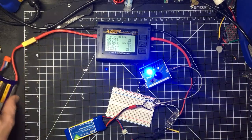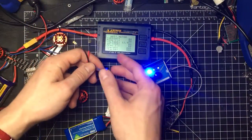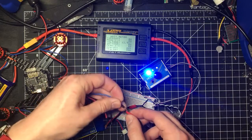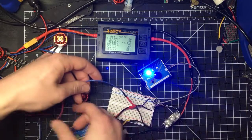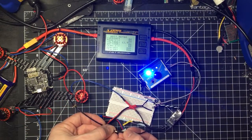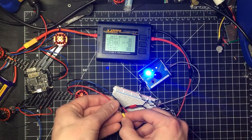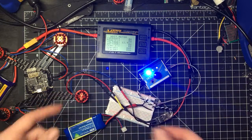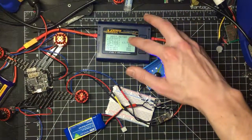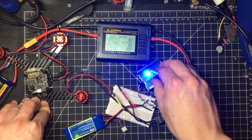And so the last thing naturally is to bring over our motor to test. So I'm going to test this guy right here. I've got my 3 plugs. Great thing about brushless motors, you can plug them in any order. It doesn't matter. If you reverse any 2 wires, you'll just change the direction that the motor spins. So pretty cool. All right, and now I'm all set up. So as I turn this potentiometer here, the motor will spin up and give me a live reading of the current that it draws. So I'm going to hold this here just to secure it. Start turning it.